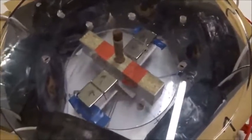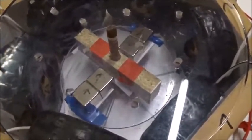Once again, when I take off the 2 helper magnets and just have 2 south poles out, it will spin anti-clockwise in accord with the UVW power, but the 4 magnets is a lot better. This is trying to start, say, at 10 hertz. It will spin up, but it's ragged.